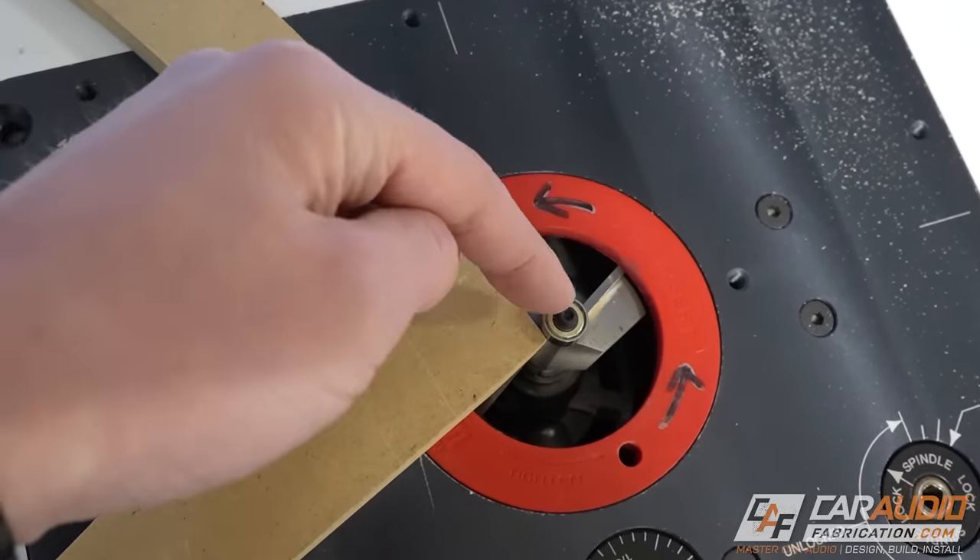We're not done yet — there are a couple more important details to add. I want to soften up the outside corners with a small radius bit, and we also have one more extremely important router bit pass on the back side of these pieces. I use this small 1/8-inch roundover bit, which just slightly rounds out the corner as you can see on my test piece. I use this around all these edges — even though it's a very small radius, it gives a much more finished look once I wrap the upholstery materials around it. Hard corners are not really a thing inside the interior geometry of a vehicle, so adding these soft corners makes everything look more refined.